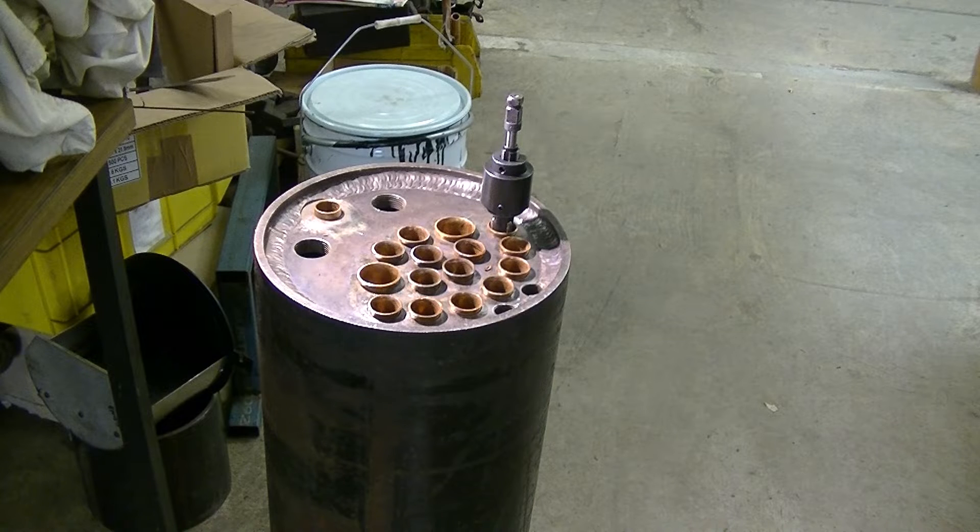Hello from BC and welcome back to In My Shed. This is the last of the boiler tube rolling. We've rolled them once, re-annealed them, flared the ends with a lathe dead centre. Now we're coming back to do a fine little nip with the boiler rolling tool. Not too easy to do as I think I'll bugger the gearbox on the battery drill, but we'll give it a go and see what it comes out like.